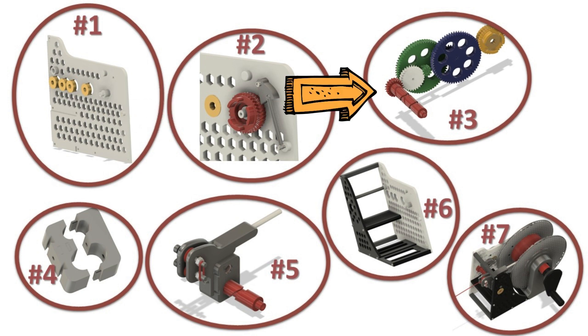The ratchet can also be folded up during operation and thus deactivated. The most complex section is the assembly of the gearbox. It consists of seven so-called herringbone gears. The red gear wheel forms a unit with the so-called double helix, which consists of two counter-rotating spirals, each with two windings. This helix is responsible for the precise guidance of the filament. The gear has a transmission ratio of 17.4 to 1, and the double helix has two spiral windings — consequently, it requires exactly 34.8 turns of the crank to wind one filament layer.